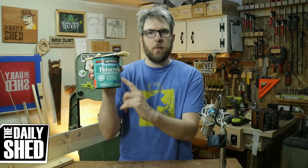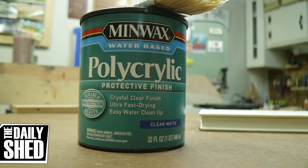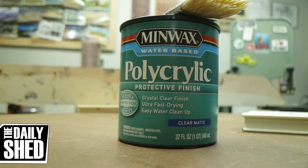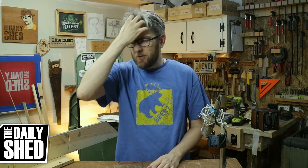This is not just water and plastic. There are also solvents in here that break down the plastic and help the drying process. But there is water, and that water will soak into the wood. That water will lift grain, that water will do all sorts of craziness — whereas with traditional oil finishes, not so much. But what I have found is if I soak it as much as I can, just slather it on and let it dry, whatever grain got raised is trapped inside the polyurethane and I don't have to worry about it. I don't have to sand for days trying to get all those little nibs off. It just doesn't happen. And it will always just dry because those solvents disperse the water and can evaporate quickly. It doesn't take very long.